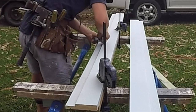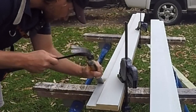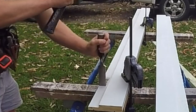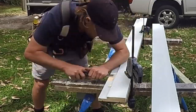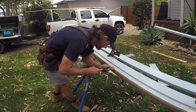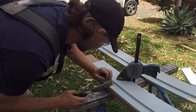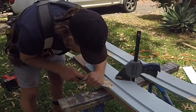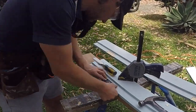Due to the rebate already in the milled timber, I will need to use a chisel to rebate the hinge locations. If the door jamb is not pre-rebated, I can use a small router to quicken up the process. Another good tip is to clamp your stiles securely to your stools or workbench and make sure your knife and chisels are sharp. Rebating hinges is an enjoyable and safe task when using sharp tools, but when you've got blunt tools, it's probably just going to end up in disaster.